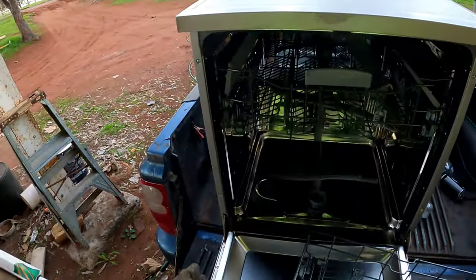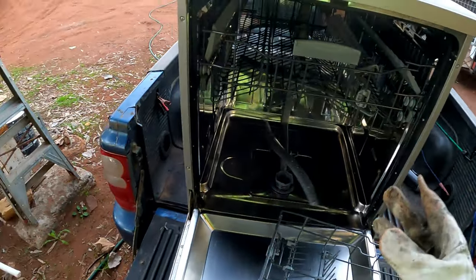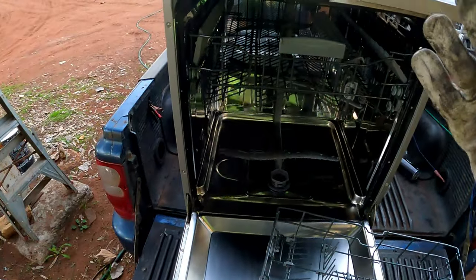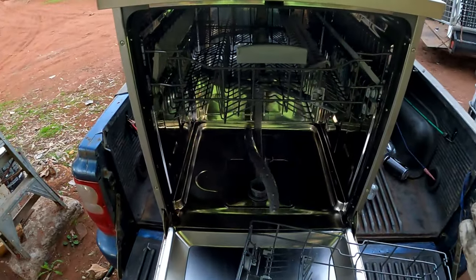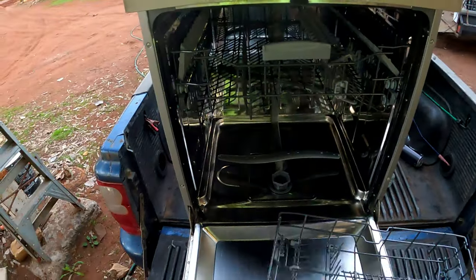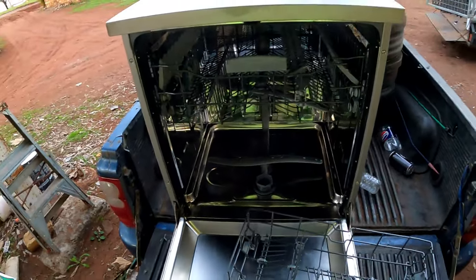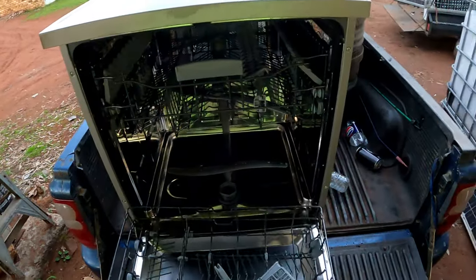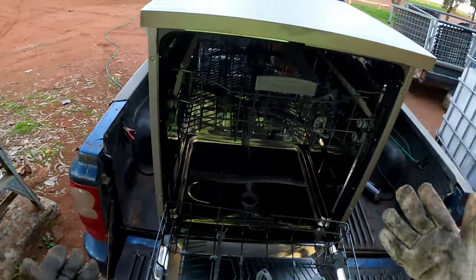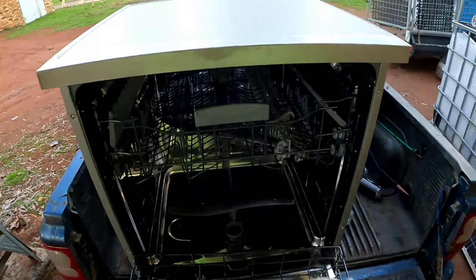Once you've got it all apart, you can actually get to it with a grinder if you want a decent price for stainless, and not throw it in as, say, shred or pressing steel, because that's what I can do, and I get a lower price. But it's quick and easy. Get the plasma cutter, cut it off, 30 seconds and it's off. Makes it so much easier. A bit of power and a bit of air compressor. No cutting wheels involved, and that just comes off.